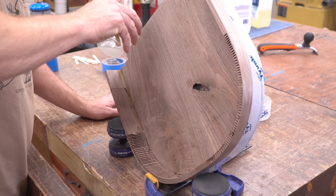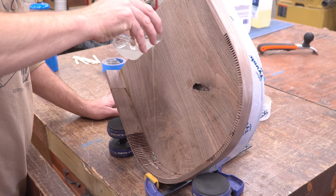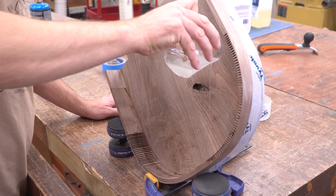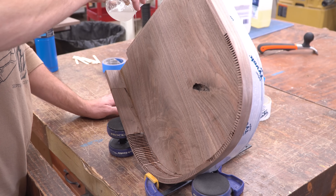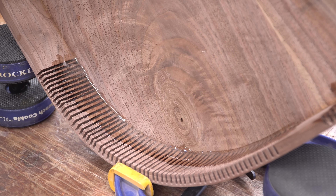Because of all those brittle little fins that this bending process created on the inside of the door, and since I wasn't sure just how well the glue was going to hold around those corners, I decided to pour some epoxy in to help fill the gaps and add some strength. I taped the backside to keep anything from leaking out, stood the door upright and leaned it back slightly. Most of the epoxy was going to pool at the lowest point, but I drizzled as strategically as I could to fill as many voids as possible. You're probably thinking that this is overkill, but you weren't here to tell me that in the moment, so I went ahead and did it anyway. Your only recourse now is to yell at me in the comments way after the fact, but if that helps you feel better, then go nuts.